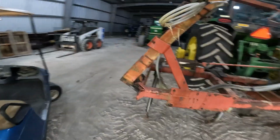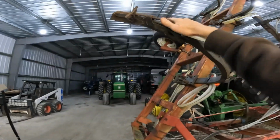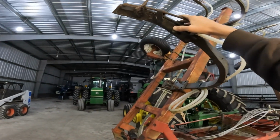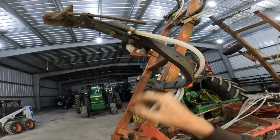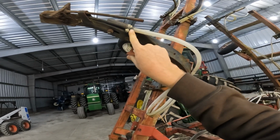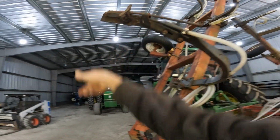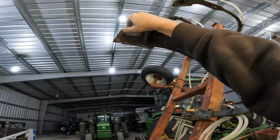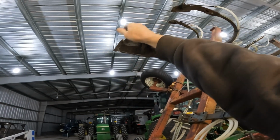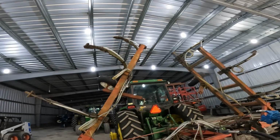But before I do anything, I've got to smack these knives with a hammer, and it looks like I even take a wire, pop the tube off, run down that metal tube, and knock any dirt out of the end here. Like that. That's got dirt in it. You can see it falling out right there. Get that knocked out of them knife holes. That way it's not plugged.